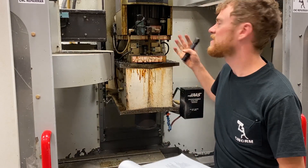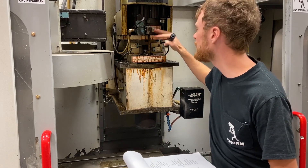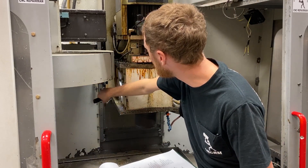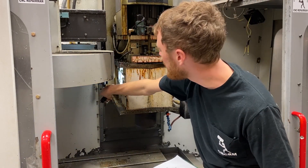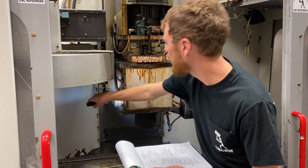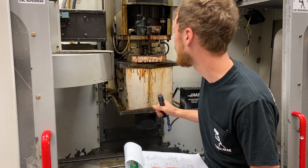While we're at the front of the machine, let's talk about everything underneath the spindle head cover. You've got the tool release piston and the switches. You're gonna want to look for chips and nastiness. You're also gonna want to take a look at your coolant hose that runs from the coolant tank pump in the back, up through the head, through the cable track cover and the gear. These things get old, hot — coolant attacks them and they break down. Check the condition of this cable; if it looks nasty and brittle, I'd recommend replacing it.